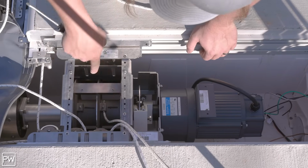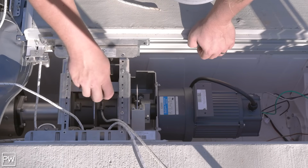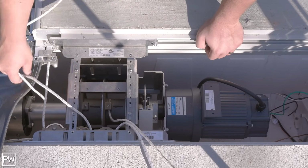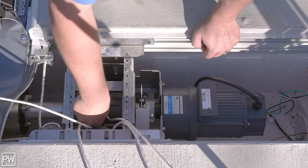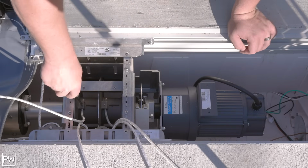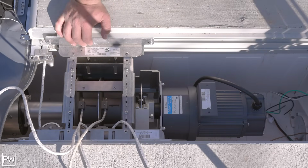I like to pull the rope about 1/4 inch past my set screw here, sticking out where I can see it. Get that flathead nice and tight. Gonna do the same thing again over here. About a 1/4 inch past. We're gonna snug this up. Just like that. Now we're ready to wire our motor and switch and run this cover out.